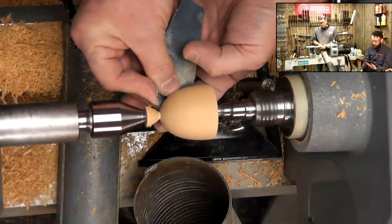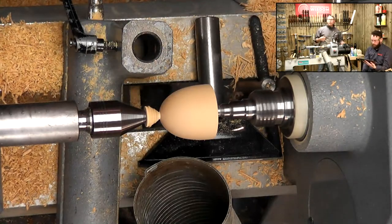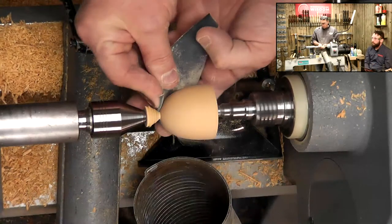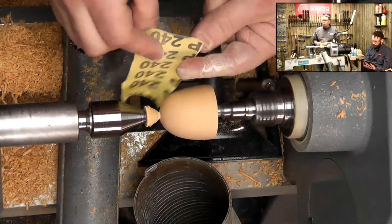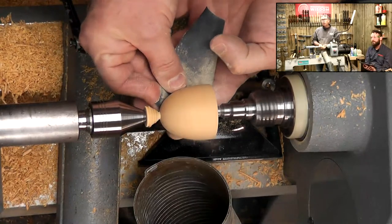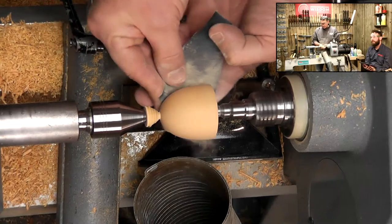This particular timber, and the yew that we were using a moment ago, will craze, it will split, if you get it hot on the end grain especially. So make sure you move your abrasive around. And don't fold it over. If you're folding your abrasive over to protect your fingers from heat, the timber's getting too hot. So make sure your fingers are detecting that excess heat.